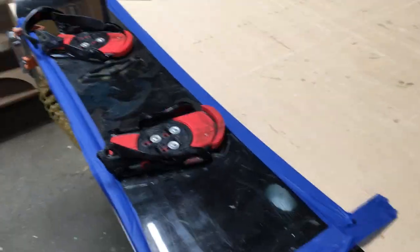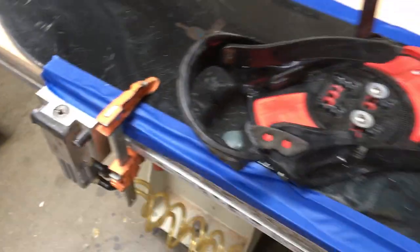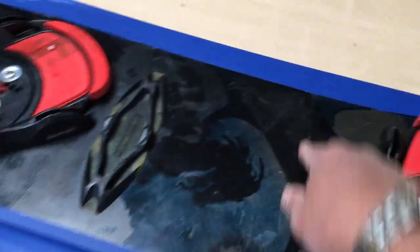If you bring up a corner you'll break the seal on the back. Tape on the other side seems to help, so you gotta tape it down. What I ultimately did was put some blue tape along the edges as well as a couple of clamps to hold this snowboard down to the router table. It uses 14 pounds per square inch — atmospheric pressure at sea level — so it's like having 14 pounds pushing down on every square inch of this snowboard. It's basically a vacuum clamp.